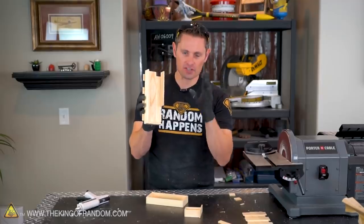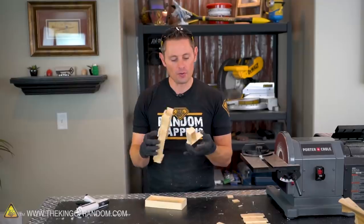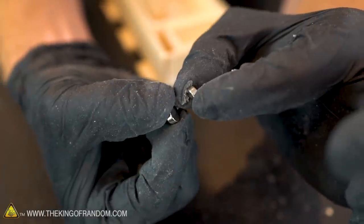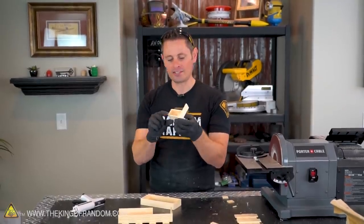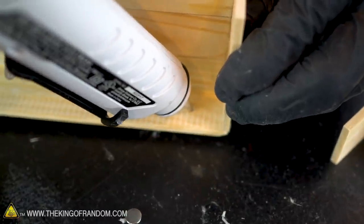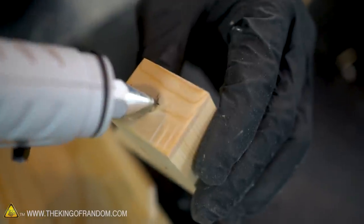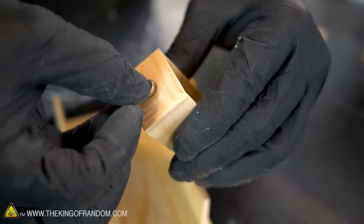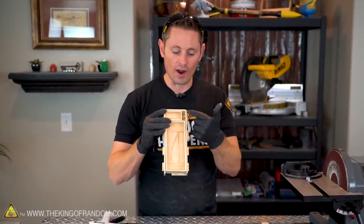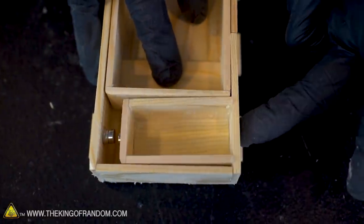We're just about ready to put the top on but there are a couple of things to do first. Take your drawers and slide them all in and out — you want to make sure they're extremely smooth with no rough edges and no hot glue that's going to bind them down. These need to just glide on top of the wood. Secondly, it's time to add our magnets to the back of the smaller drawer. By using two opposing magnets it's going to give this drawer an effect like a spring so it pops out when the catch is released. If you find you were a little overzealous with how wide you made the gap at the back, you can easily solve that by adding one more magnet.